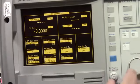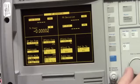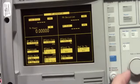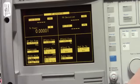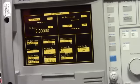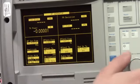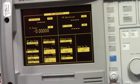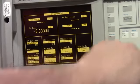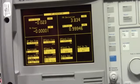Right, so let's zoom in here on the screen. So we're going to RF generate at 146.535 as well. We want to go out into the RF out. We want to generate 1 kilohertz at 3 kilohertz deviation. We want to generate 127.3 hertz at 600 hertz deviation. So again, this is our PL tone that we're emulating here, and this is the actual check tone that we want to feed into the SR1. So now if we turn on the generator and set it to a reasonable level, like minus 80 dBm, you can hear there's our tone.